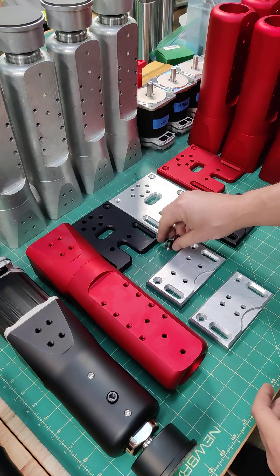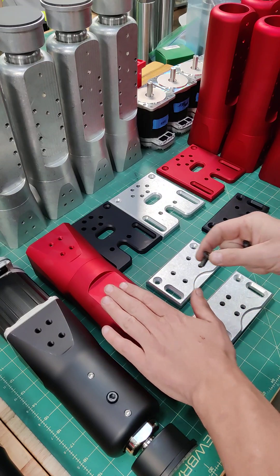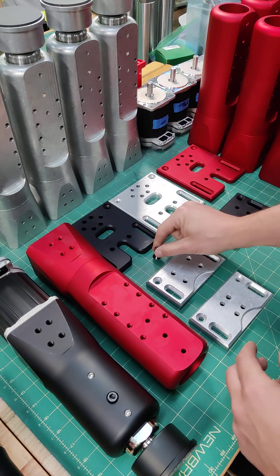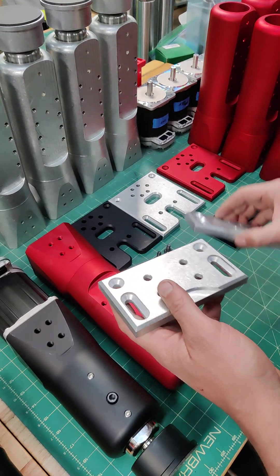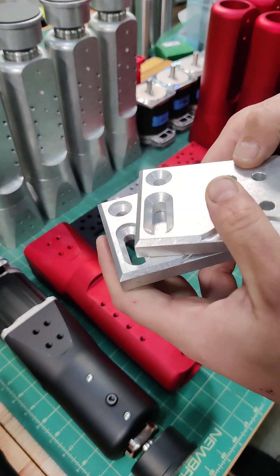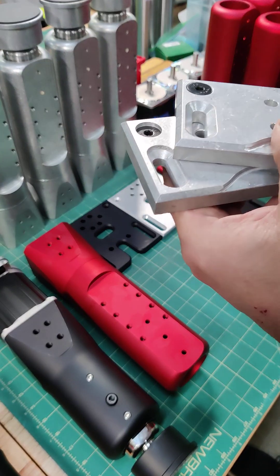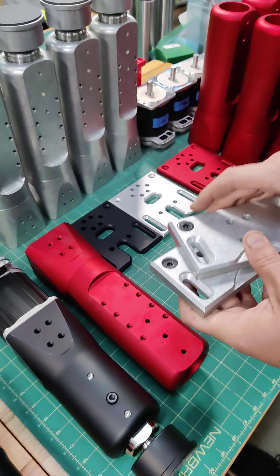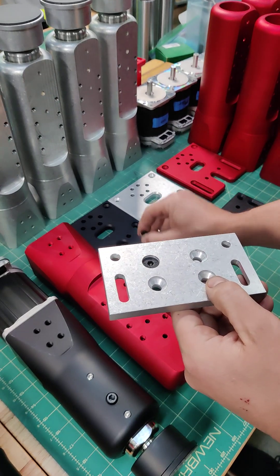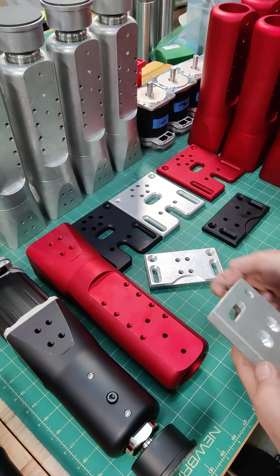In order to standardize everything, we used to provide two lengths of bolts with the DK6 — the 25mm and the 20mm — because each would seat differently depending on position. But based on feedback from you guys through YouTube reviews, we recessed the hole on the new brackets slightly deeper. This means the bolt no longer sits flush but seats deeper inside the cavity, and it still gives us the bite we need for any mounting position. So now you get one type of bolt, and you figure out whether it goes into the actuator or the chassis.